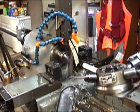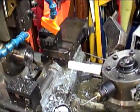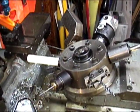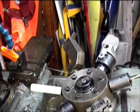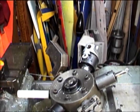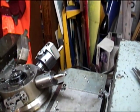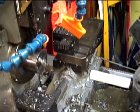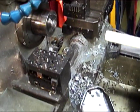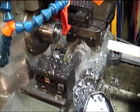Let's go ahead and make a part. This is a heat sink for slot cars. The turret's loaded up with a stop for feeding the stock, then a knee tool for cutting down the diameter. I'm using a boring bar to cut down the diameter some more from the bottom side. Then the center drill, drill, tap. I come in from the side and cut the fins for the heat sink, and cut down another part of the diameter as well as face the part right there on the front cross slide.